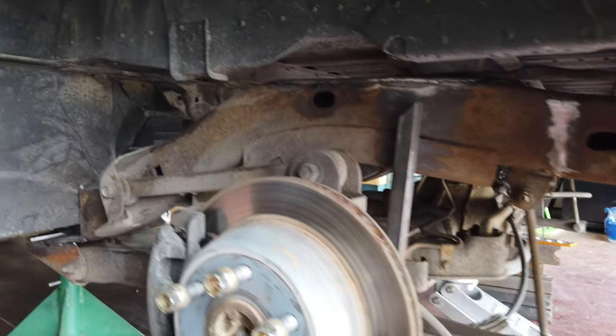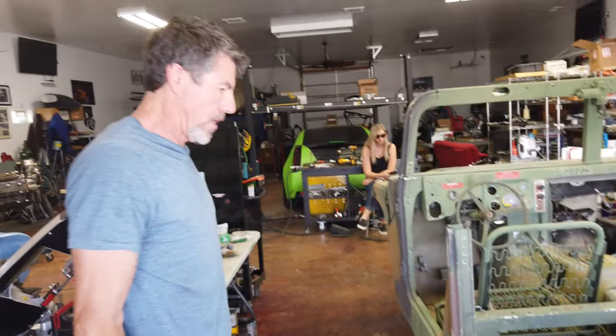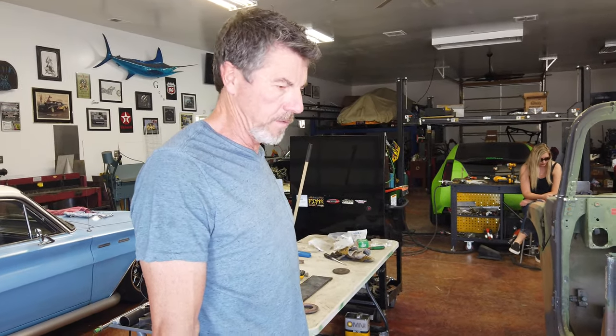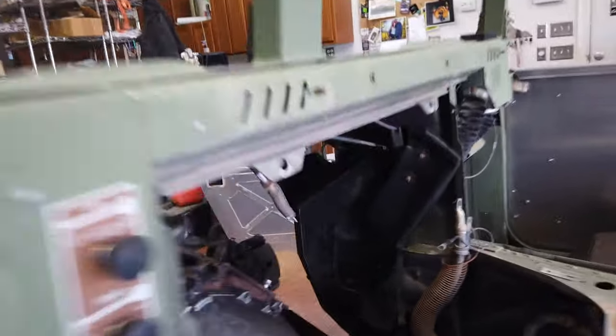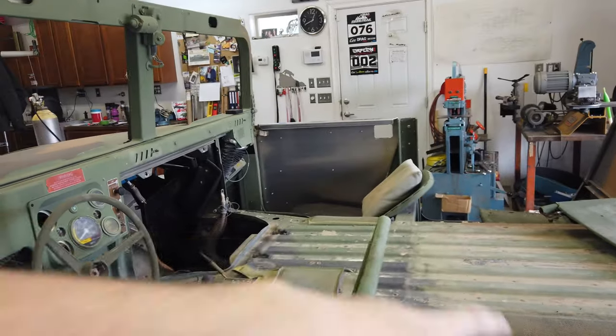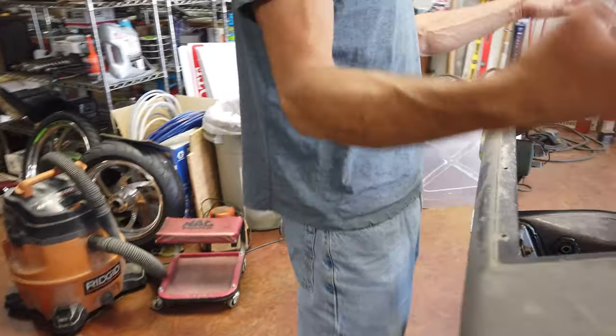Most guys want to keep them four-wheel drive, which you could have stayed right on the frame where it was and built everything up. Or you're trying to sink the body. There's not a lot of these builds where they've done it this way — I don't even know if there's another one. I think I've seen some renderings, but they're on a completely custom chassis, not necessarily using a Suburban chassis. You can see he kind of got his chassis mounts in there. So he has two there, two there, and two in the very back. There's actually six for the body and then two up front, and then it just hooks to the front, so this section is its own.